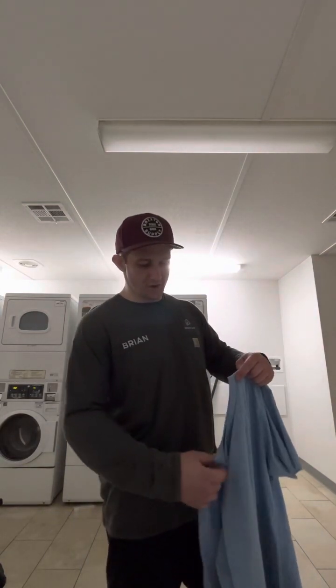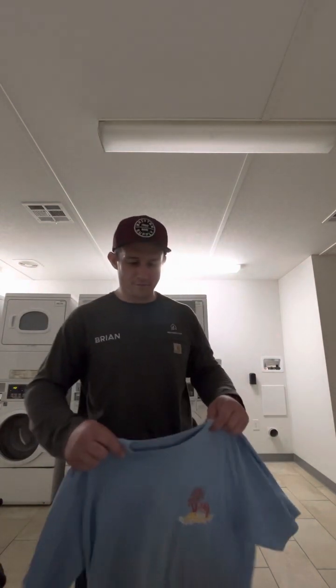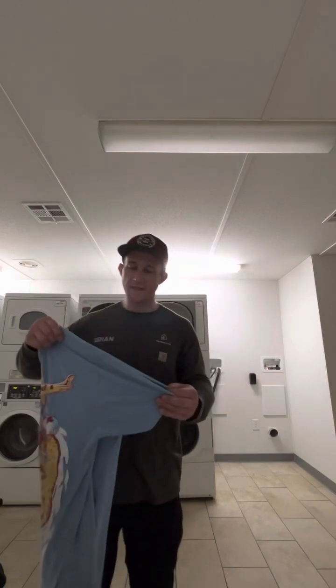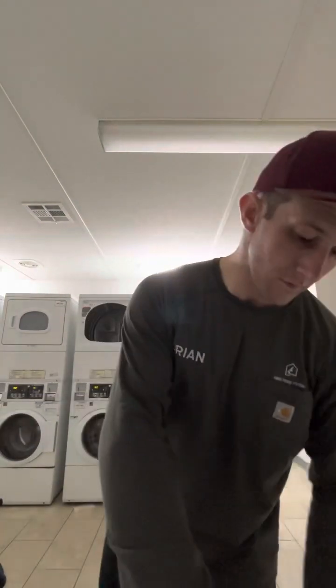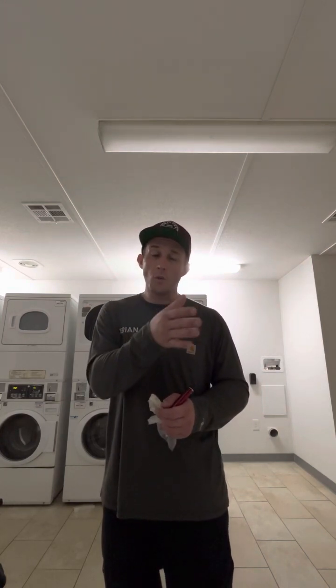When you're looking for a generator, don't ask people what size. You literally are the only one that will be able to figure out what size you have. It's very simple. Every single thing that you plug into the wall uses electricity. And on the back of things, on your hair dryer, on the refrigerator, there's going to be a bunch of information. It'll say how much electricity, 120 volt. Sometimes it says like 115, 110. Sometimes it goes 120 to 240. Then it'll show you your amperage or wattage.